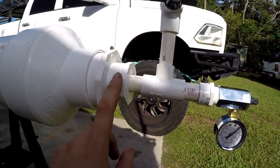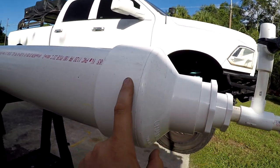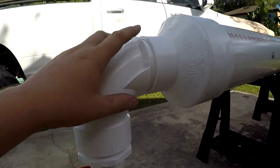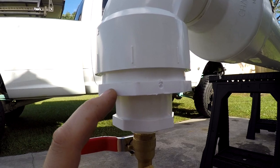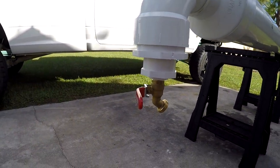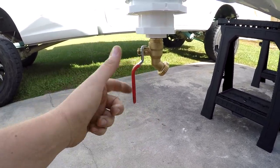Going down: three-quarter by two-inch adapter bushing, two-inch by three-inch bushing, three-inch by six-inch bushing, then our six-inch pipe that's not cut yet. Then coming down: six-inch by three-inch, the three-inch street T goes right in there — keeps it nice and clean, here's the coupling part. Then three-inch by two-inch, two-inch by one-and-a-quarter, one-and-a-quarter by our half-inch interior thread, and then our ball valve hose bib. It is a ball valve-style hose bib — you can do the crank style but this is so much faster.